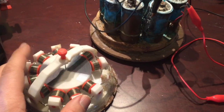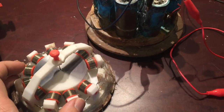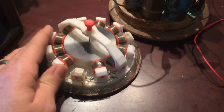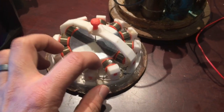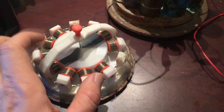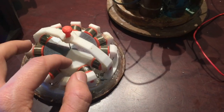I call this one the hundred-year motor — I was overly optimistic. This motor has run for one and a half years so far. During that time I've had multiple reed switch failures, and today it stopped again because of the reed switch. In transportation one of the coils broke, so I've updated the easy spin design since I made the first one.